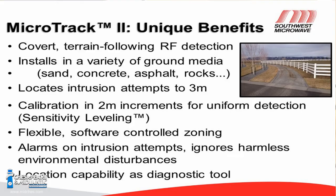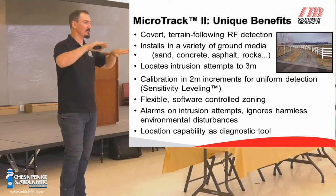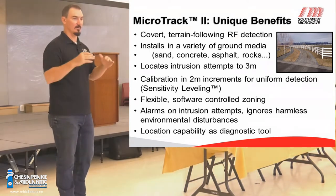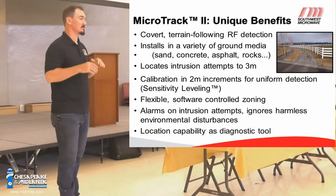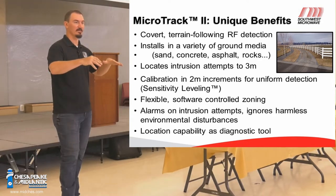The system is completely covert — you can't tell where it is if it's installed appropriately. Usually you put it in the ground and put some rocks over the top and smooth that out. Sometimes it goes into an area where there's no gravel on top, and what can happen is the trenches can settle and you get little depressions. If that's the case, you can add more dirt back on top and tamp that down to completely cover it. What we don't want is cables getting exposed or water pooling in those areas with a large surface area.